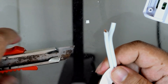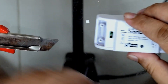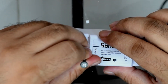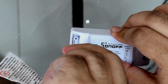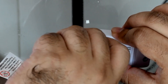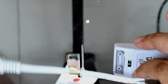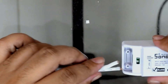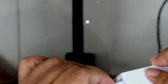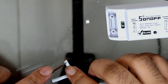We could have cut that a little more but it should be fine. Double-check by pulling — at this point we're just testing, so it doesn't matter, everything is off. Make sure to have all power off when dealing with this device and 110 voltage. Make sure to line up the wire so that the thinnest side is on the L side. Push it in just to check it fits properly — about two millimeters, let's go one more.